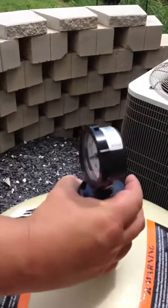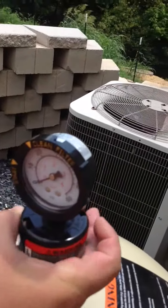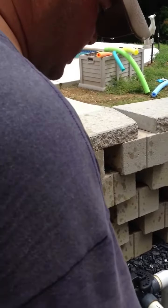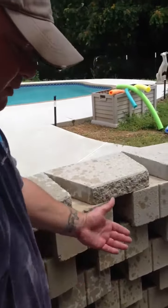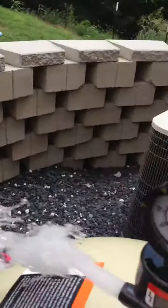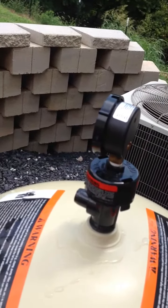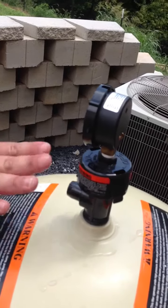This is what we're talking about. See how it looks there, how it kind of has the air in the system. But either way works. Watch — there's your prime coming back to the pump. So anytime that you have any air in the system, you release it from here.